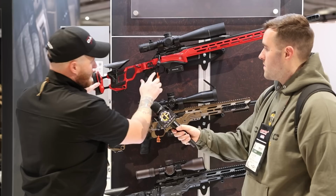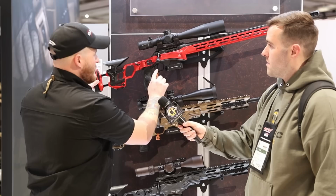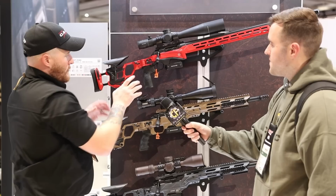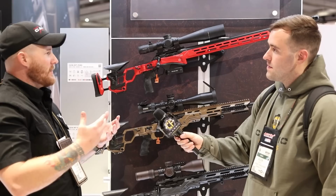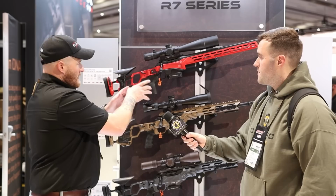The trigger we came out with to go with the rifle is a straight shoe. The straight shoe can be adjusted forward or back via a dovetail interface on the actual bottom of the trigger. And if you need a little bit more real estate forward, you can flip the shoe around and it pushes that purchase a little bit farther forward. Now when you look at people's hands, when you have, call it, five people with the same body type, you look at their hands and those are wildly different in most cases. So we really looked at that because that really customizes it for that individual.